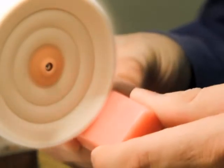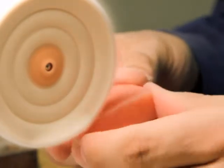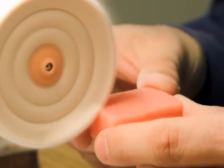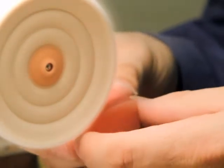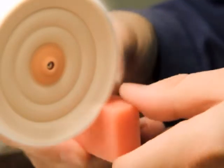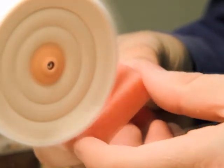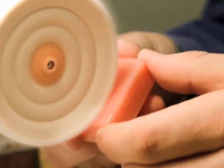So to review: simply load the buff with a quantity of Acromarvel and apply to one area until it is totally shined. Unlike pumicing, wherein you have to continually add pumice to the wheel, we only make a single application to the polishing buff and use it until any given area is polished. Note that Acromarvel will not fly away from the working area and therefore does not need to be replenished. Keep in mind that whenever additional material is added to the wheel, the polishing process is caused to start over in accomplishing its job.